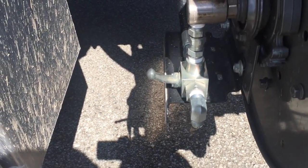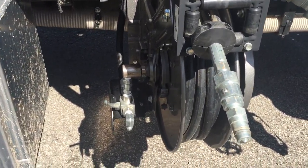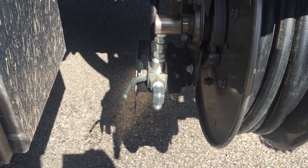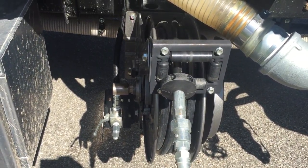Going a little bit lower, next to the tank between the toolbox if it is mounted and to the side of your wash down gun reel, you also have another purge and drain valve that will allow you to purge any sediments or unwanted water from the hose reel or that line.